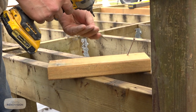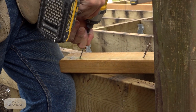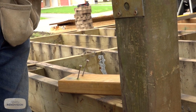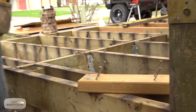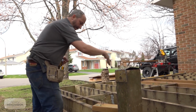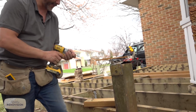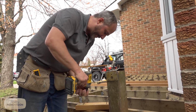So with this, I'm just basically doing a splint, knowing that I put enough screws in this block, and that is basically 6. I have 500 pounds of shear strength in this one corner. So I would have to fit 6 adults between that wall and this corner, and between here and here, jumping up and down with all their strength simultaneously before we are having a risk of heading on structural failure. I'm pretty sure that we're not going to end up with that kind of a scenario.